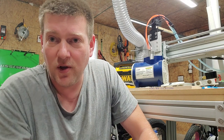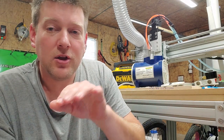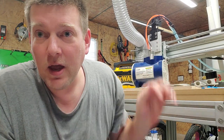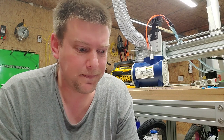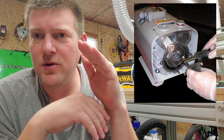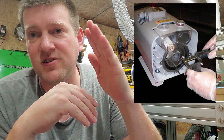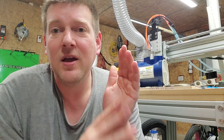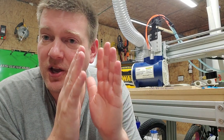Notice that's a trend with all these pumps — since they have an inlet and an outlet, you can reverse the flow, usually by reversing your reed valves, and turn a vacuum pump into an air compressor. There's a lot of similarities between air compressors and vacuum pumps. Some rotary pumps require oil; some run dry. But all rotary vane pumps will eventually need to be pulled apart and cleaned. As these carbon or composite wipers come in and out of the slots — after 50 or 60 hours or so of run time — you're going to get debris that can end up clogging your rotary vanes.